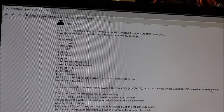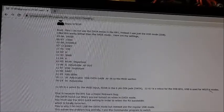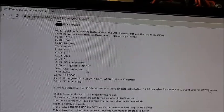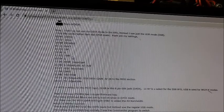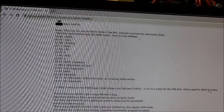Here is the website. These are the settings that you're going to want to have on your radio. The most important thing when you're operating sideband FT8 — because data mode just does not work for this radio — is to go into your settings and mimic everything here. I found that all these settings work absolutely great. Right here, the important one is menu 1105: you switch your mic input to rear. Don't leave it on mic, put it on rear. That is very, very, very important.